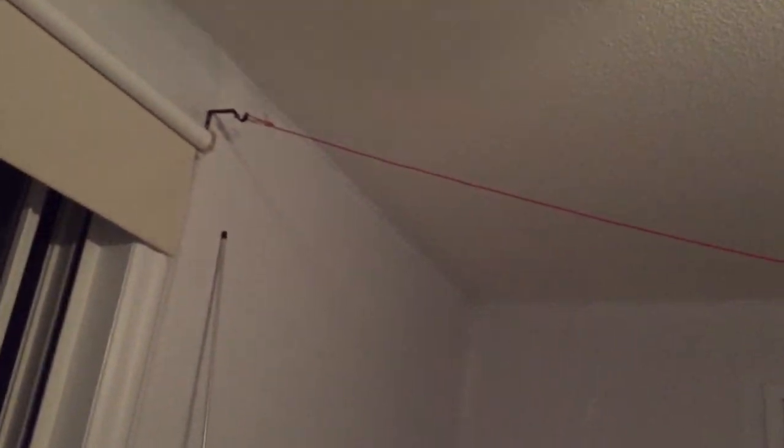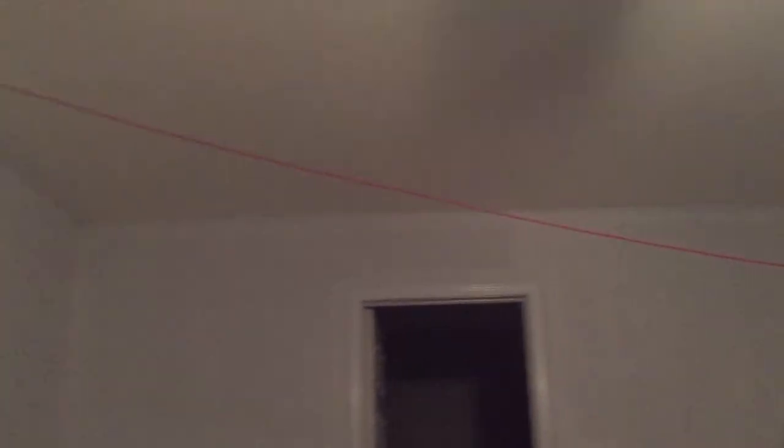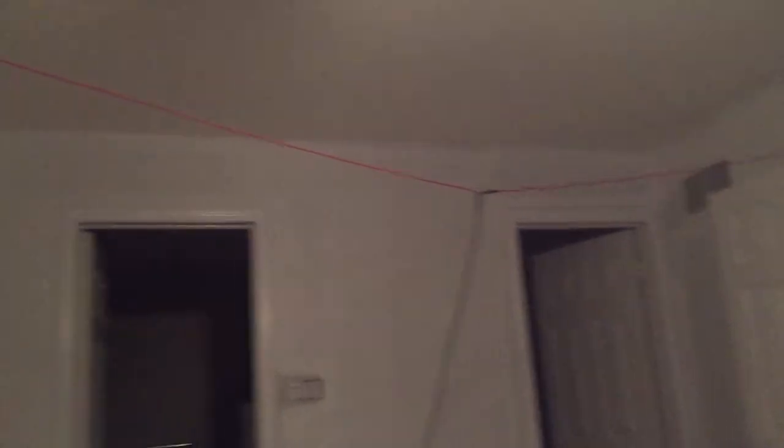Here's my indoor antenna — about five feet in each leg, so roughly a ten-foot dipole. These are all going outside eventually. This is my air band antenna — it's a magic antenna, a solid antenna. I can pick up aircraft from Toronto probably all the way to Montreal, a 500-kilometer radius, just from this antenna being in my room, not even outside. Beautiful antenna — I think it's a five-eighths wave.